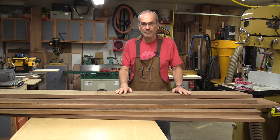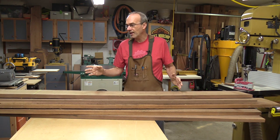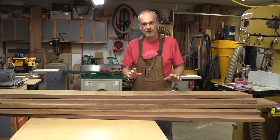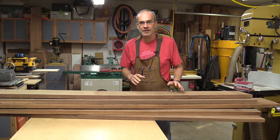Like any project, I'm going to start out with some rough lumber. I've got some here, I've got some over there. I'm going to cut it to rough length and I'm going to surface it four sides square — just the initial milling to get it flat and square. As I need the pieces, I'll remill them again to use them.